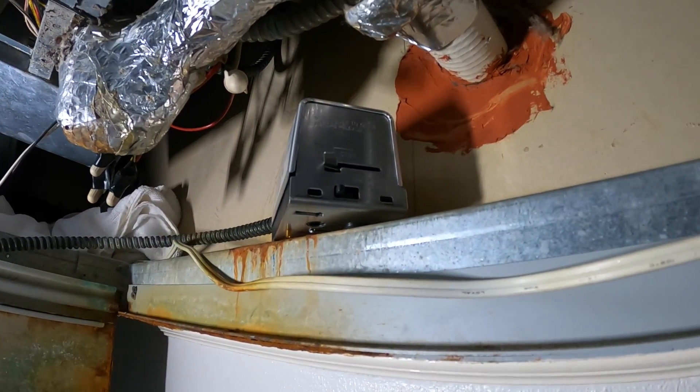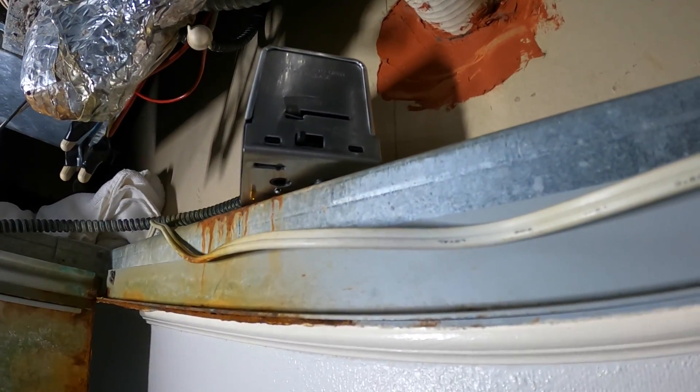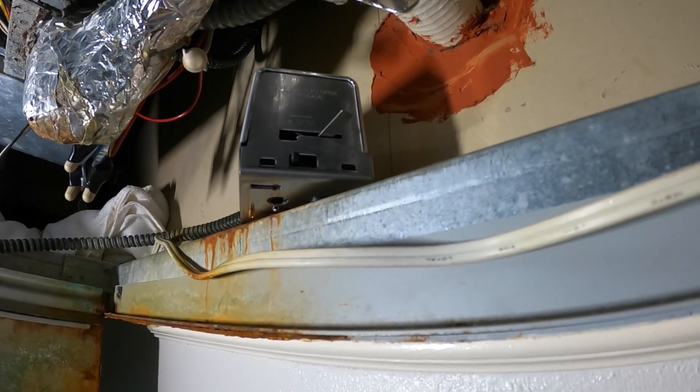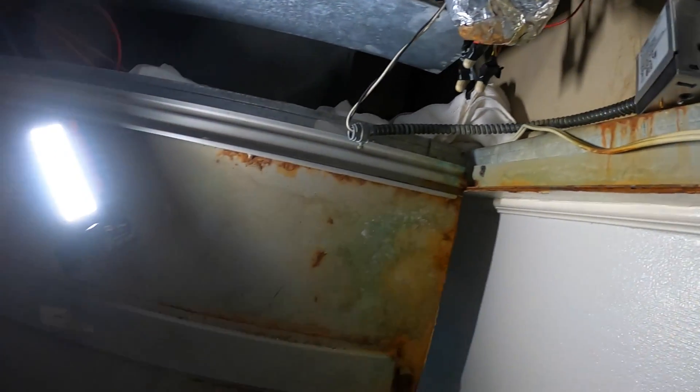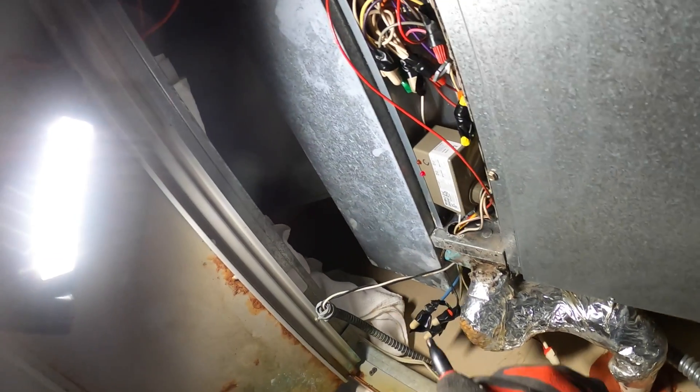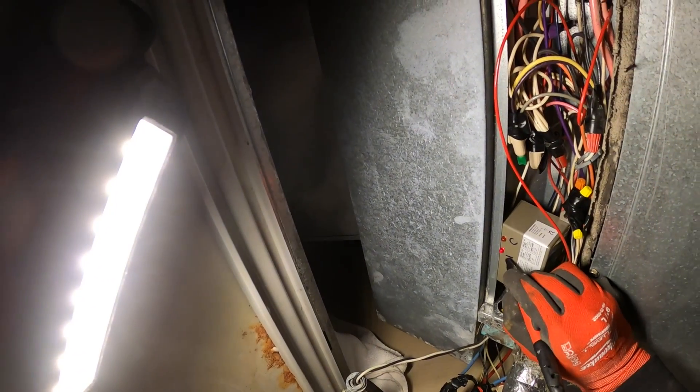When you kill the power it's supposed to just spring back. Put the system on off — and it springs back. That's good. Let's put the system on heating. It's a good indication, because sometimes with these auto changeover switches — the pipe sensors — they energize both heating and cooling at the same time. So this is the heat. Pipe sensors — so far, seems to be doing its thing.